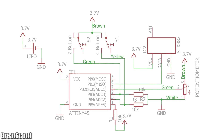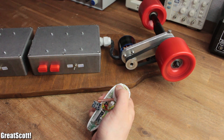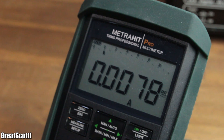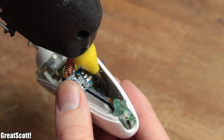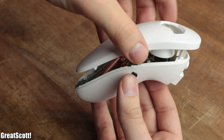Now it's time for the wiring. The pins of the ATtiny85 can be spread out in order to solder the resistors directly onto it, and afterwards I did the rest of the soldering according to my schematic. It's always a good idea to test the device during construction, and I also measured a current draw of nearly 8 milliamps, which means the controller can run off one charge for a huge amount of hours.